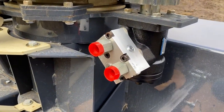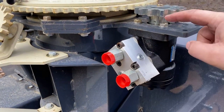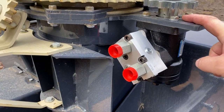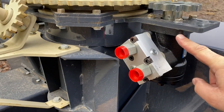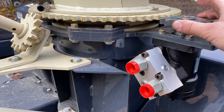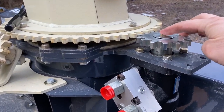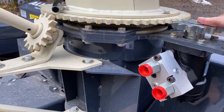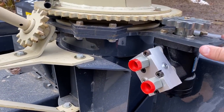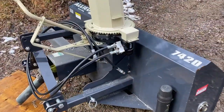There are no instructions showing how this thing goes together, so I looked at some pictures on the internet. It looks like this is the way they basically have it set up. First thing you do is hold your motor up from here and run these bolts in from the top - they're 9/16th bolts. This is threaded so you don't need nuts - goes together very easily. Then you drop your gear on top and that's held in with a retaining bolt. Next there's a cover that goes on here to cover up this assembly, then we'll go to the hydraulic hoses.